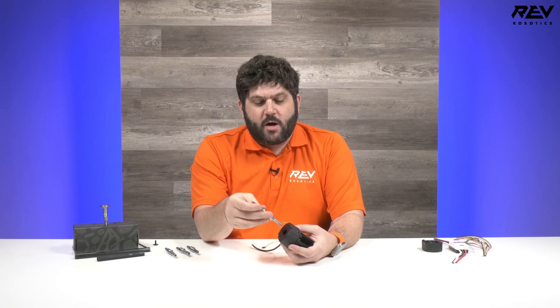We have a spline shaft that's compatible with Falcon motor accessories. We also have a seven tooth 20 DP gear pinion — this is the smallest pinion direct to motor that has ever happened on a motor of this power, allowing you to do really large reductions in a single stage. And lastly, we also have a special shaft designed for the Max Planetary which eliminates the need for the cup and will directly connect to the spline on the back of the Max Planetary.